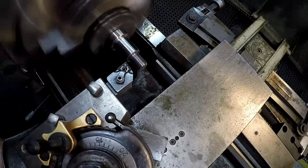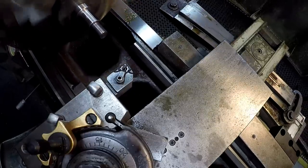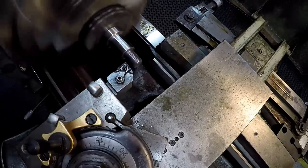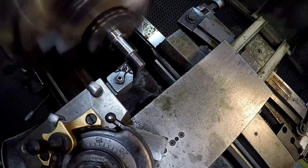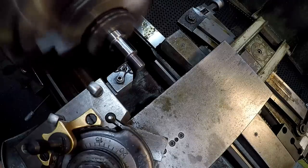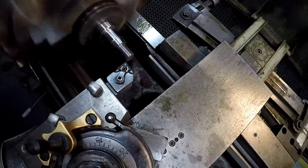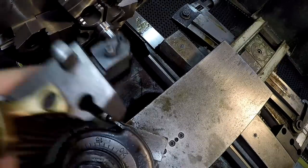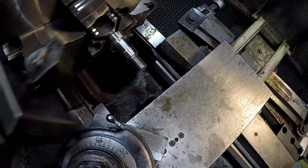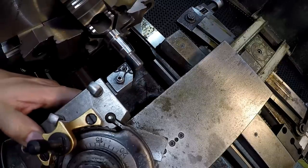Using the compound to touch that corner off there, and I'll probably end up having to take the tool out every time so that we clear the thread because you've got to eliminate the backlash there. It's going to try to hit it there, so I'm just going to go ahead and take it out, move it past it and drop it back in. Maybe we can do it like this right here — there we go.